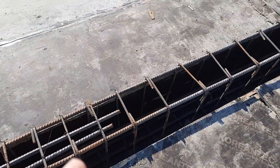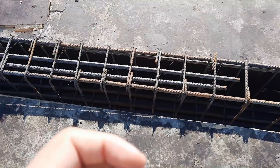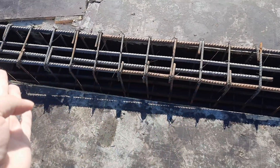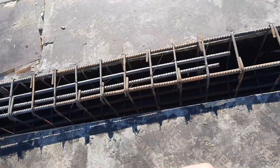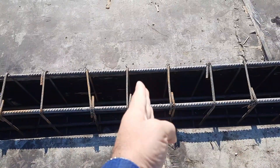The size of this floor beam is 12 by 18 inches — width is 12 inches, depth is 18 inches. You can see we have two extra steel rods at the middle of this floor beam construction to resist negative bending moment.